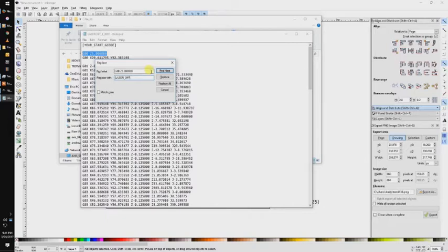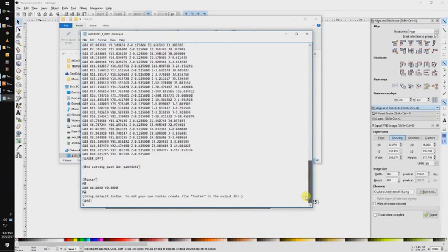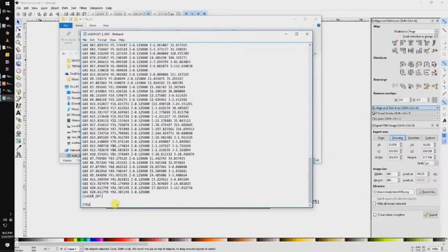I'll also note that if you're using Marlin, you'll want to make an M400 call before every laser call. This will finish all the moves before changing the state of the laser. Without this, the laser will turn on or off as soon as this code enters the buffer. We also want to change all the lines where we call the tool head to penetrate into the workpiece and replace them with the code used to turn on the laser. And finally, we will make some end G-code.